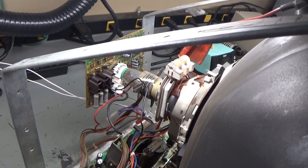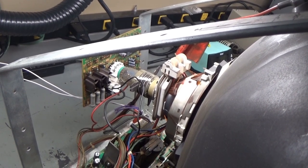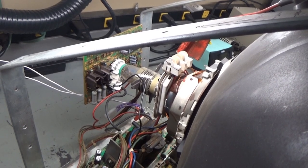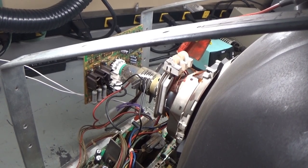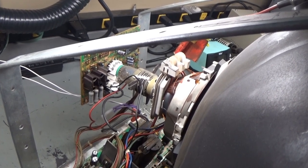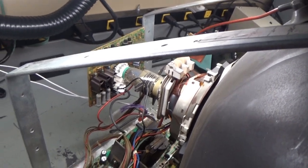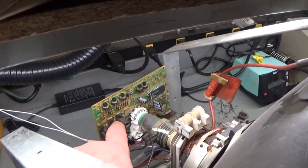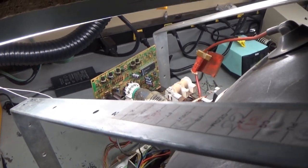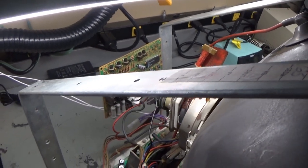But the pad was still connected to the board, but the trace was broken. So reflowing the pad didn't loosen it from the board, and it didn't help me reconnect the trace. It was a broken trace on that resistor that was causing the open. And we also had the bad little transistor here for the green. So it was a double fault issue there. So we had that bad transistor for the green, broken trace for the red on the resistor.